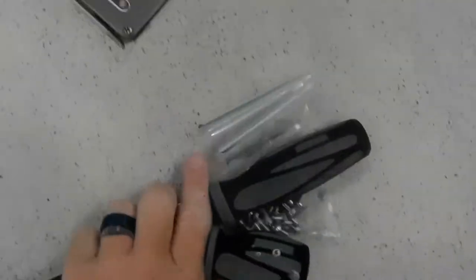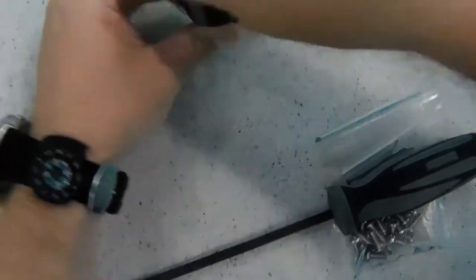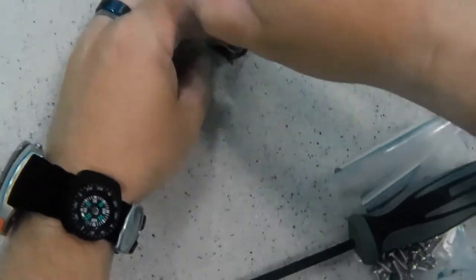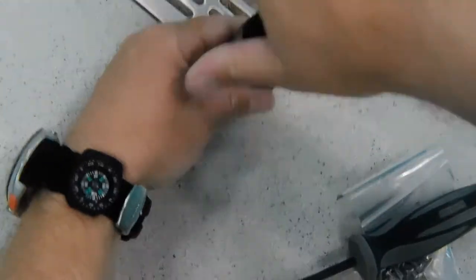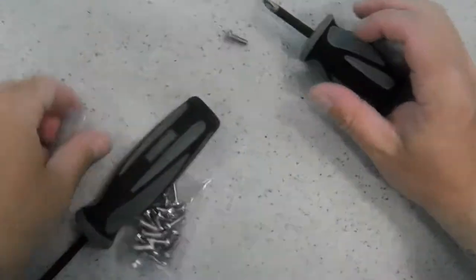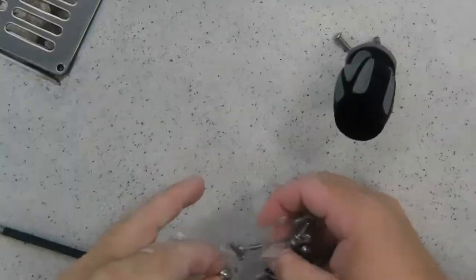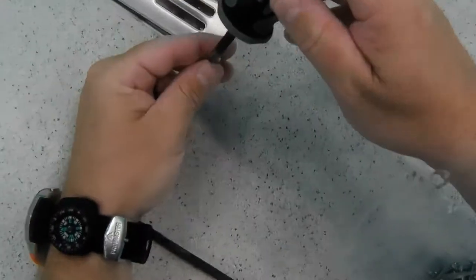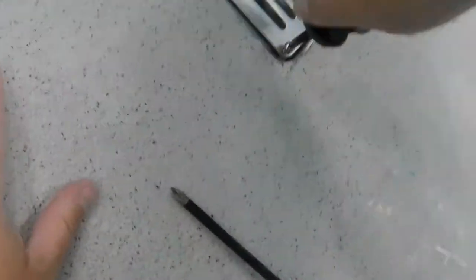Let's go underwater and replace the screws in these grates. I made a similar video years ago about delta P or differential pressure. Basically, if you've got two sides of a system — a high pressure side and a low pressure side — the high pressure side always puts more force on an object going through a smaller opening. There's actually more pressure on the upper side of these grates than the lower side, so an object or person could technically get stuck to these grates.